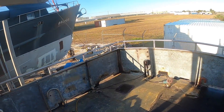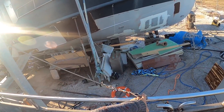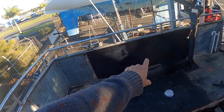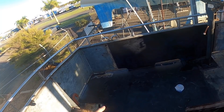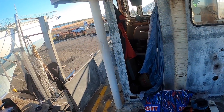I gave the new railing a light polish. I've also welded on some stainless chain to attach our awning to. Over here I've put a couple of coats of rust converter onto the steel. This steel was previously sandblasted so it has a profile on it. Just need to get the surface rust treated, turned into the tannates. I've been needle gunning the back wall here in between previous jobs.